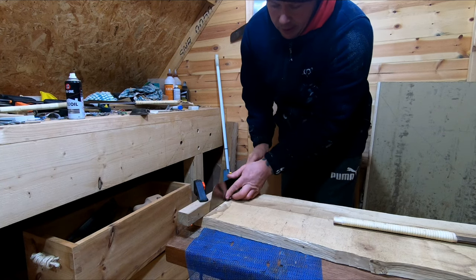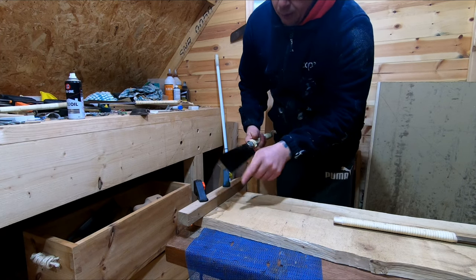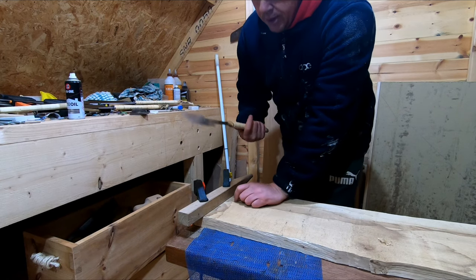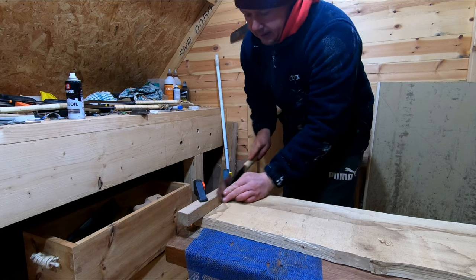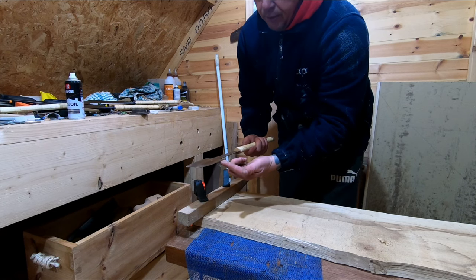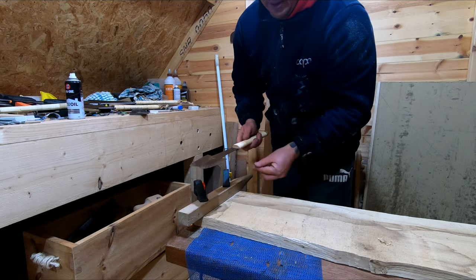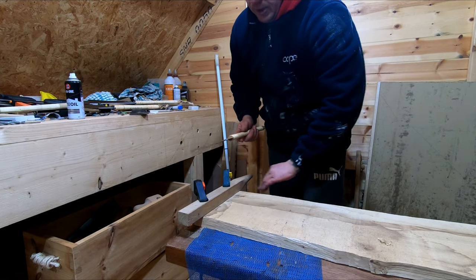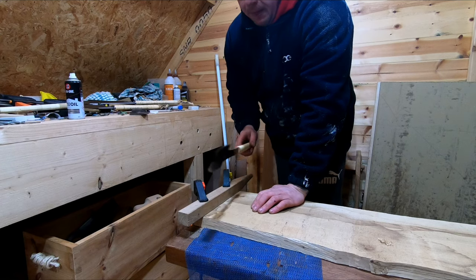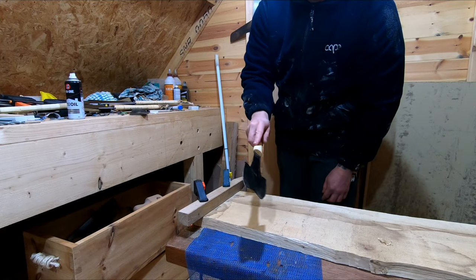As you can see, the blade is curved on both sides, which allows you to tilt the saw to one side. I've set up a scrap piece of wood clamped as a fence — this is how you'd do housing joints with this saw. The difference with this one is you can actually tilt it, whereas another saw would be restricted by hitting the edge of the workpiece. One thing I don't like about it is the teeth get clogged very quickly, so you have to frequently turn the saw and clean the teeth.